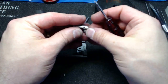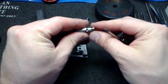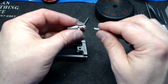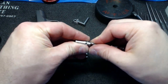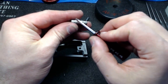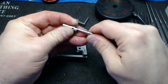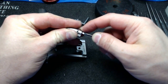And if you haven't had 1911s, what's happening there is this mechanism. There's a spring and a screw head with a little side extension, and that side extension, when it's in the frame, is what holds the whole thing in. When you're taking it out, you're tucking it so that it's hidden inside the body of the mag release. Inside the frame itself is a little groove, so that when you put it back in and you rotate this, it gets stuck in that groove and becomes non-moving, and then the button is being pushed in and out from the other side.